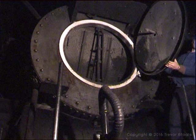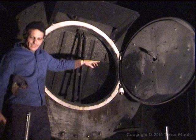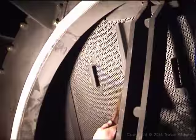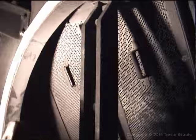Close the smoke box. Keep it airtight. So if we want to come up two at a time and gather around here, we'll see what we mean about the smoke box. It must be inspected, and why. Inside here, spark arresters. You can see they're clogged up. What you must not do is take a hammer and bang on there. You're not to use a hammer at all in a smoke box, okay?